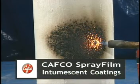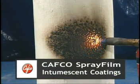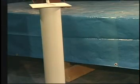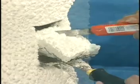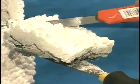Cafco spray film WB2 and WB3 are water-based intumescent coatings for the fire protection of interior structural steel. In a fire, spray film will intumesce or expand up to 25 times. The result is a dense char that will insulate and protect structural steel for up to 3 hours.